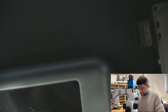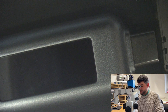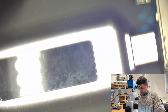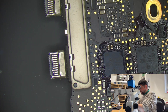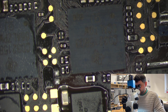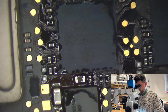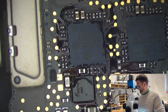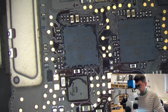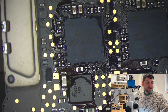This port is working, but the other port is dead. In that case I need to replace another chip. Basically, this one burned and this one got damaged as well — or maybe this one got damaged first and this one got cooked later. Anyway, doesn't matter. I'm gonna replace the second one as well.